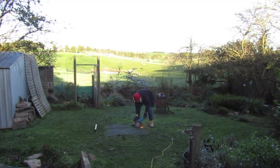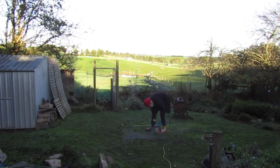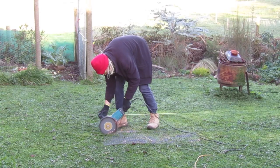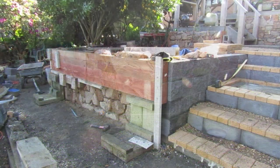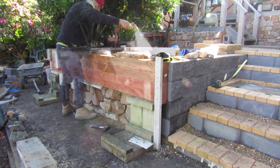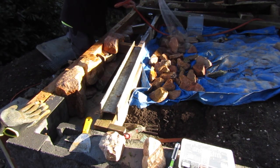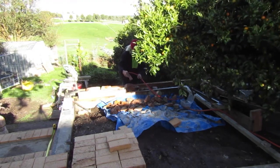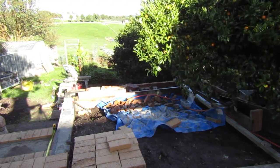I need to prepare some of our recycled steel elements for the last course of this wall. Here I'm cutting this galvanized mesh into strips that'll add a lot of strength to this last course of the wall. After raising the formwork to its final position, we wet the whole system down as we've been doing throughout this entire project. Making sure all your materials are wet before you add concrete or mortar is critical. This will help them bond and join together properly.